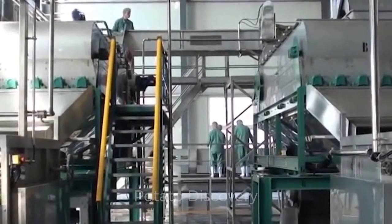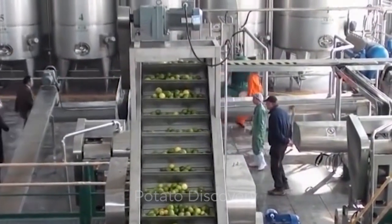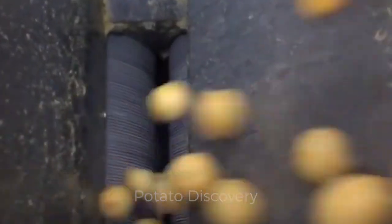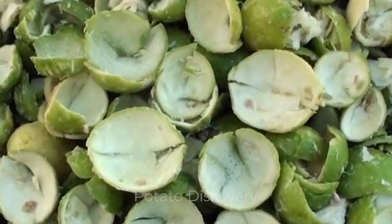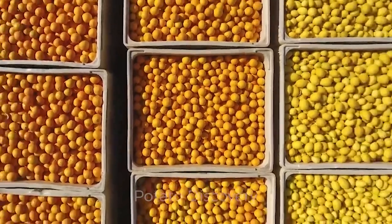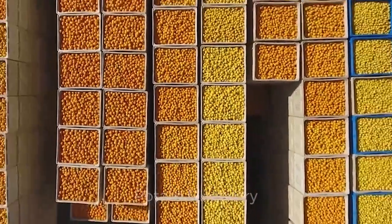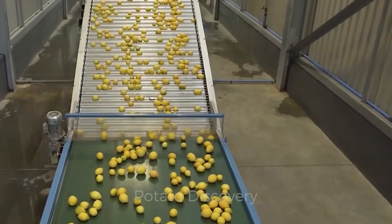The two main types of equipment employed for crushing limes are the roller crusher or the screw press expeller. The juice extracted by the crusher should pass through screens for the removal of coarse pulp and pips. The waste skins can be removed either by a suitably placed conveyor or by a removable waste box. The former is preferable, particularly when working at maximum throughput of the machine.